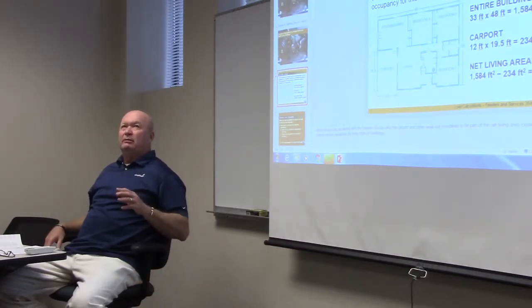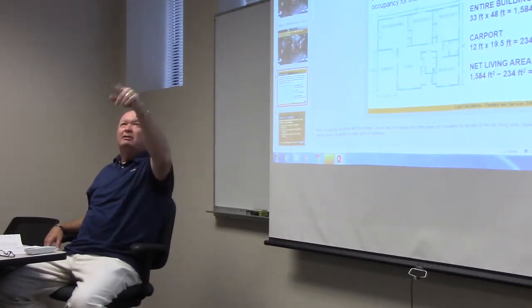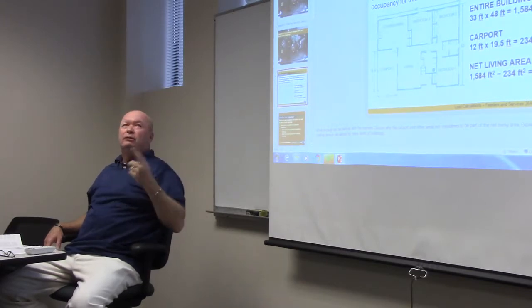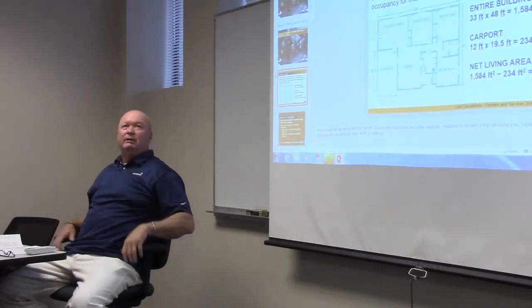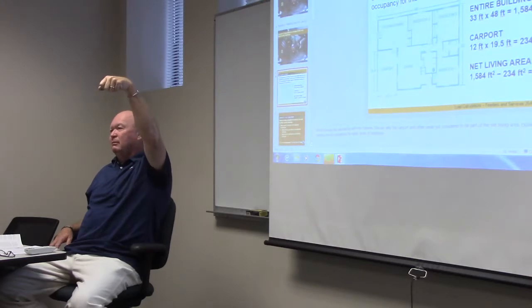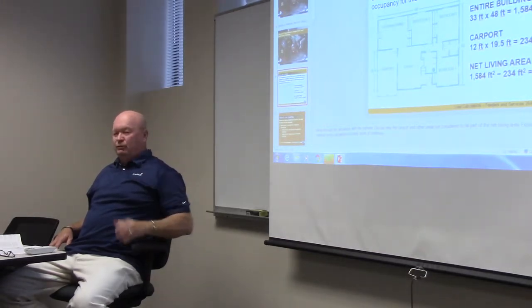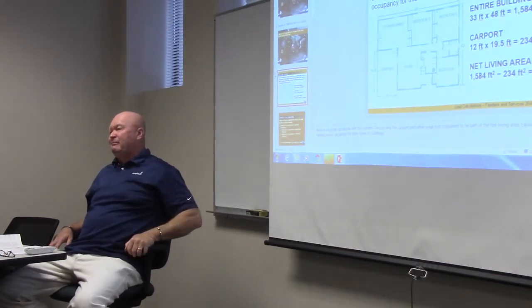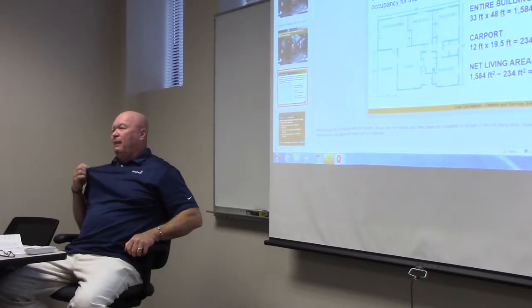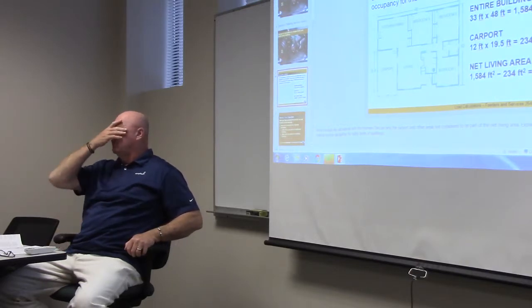I'm going to ask a dumb question. I'm just curious. Let's say you're working in this ceiling, changing this light out. You could do it off a 6 foot ladder. Well, maybe not, probably an 8 foot ladder. So you're saying you have to take out a tile, climb up, tie yourself off, just to change that light? As long as your feet do not get over 4 foot, you don't have to. But you would be over 4 foot. Yes, if your feet are above 4 foot, they require you to tie off. And if you get caught not tying off the very first time, no ifs, ands, or buts, you're gone. You're run off the job.